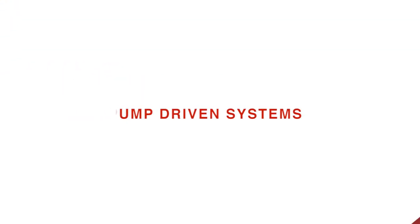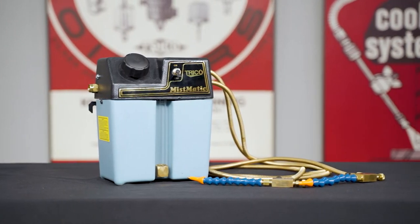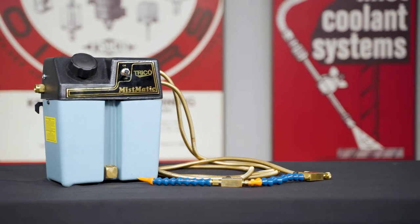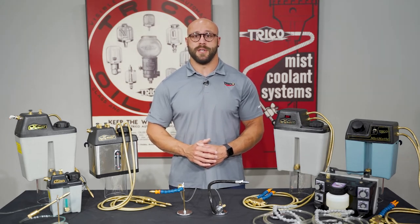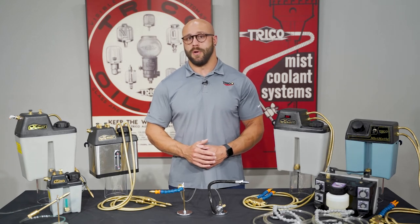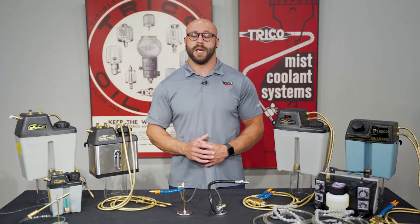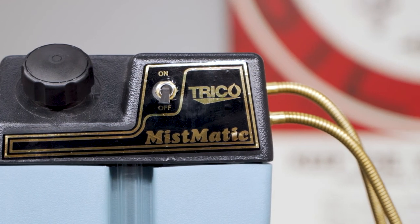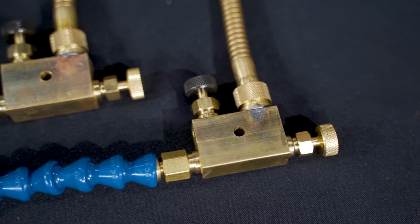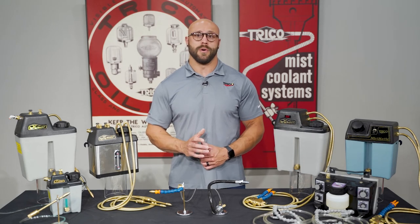The next category of dispensers is pump-driven systems, which includes the Mistmatic. The Mistmatic is powered by an air-operated diaphragm pump, allowing it to be used with water-soluble coolants or oil-based lubricants up to 1000 SUS, which is equal to an ISO 220. The variable adjustability allows for deliveries such as lean, rich, high-velocity, or low-velocity, depending on the application type. The Mistmatic can fill many flood applications with the use of the dual control valving and covers multiple metal removal processes ranging from broaching to grinding. Auto-electric models can be interfaced with machine controls for cyclic capabilities. Like the Spraymaster 2, this unit also comes with independent air and liquid controls at the 7-inch lock-line nozzle and either an on-off rocker switch or solenoid-controlled operation.